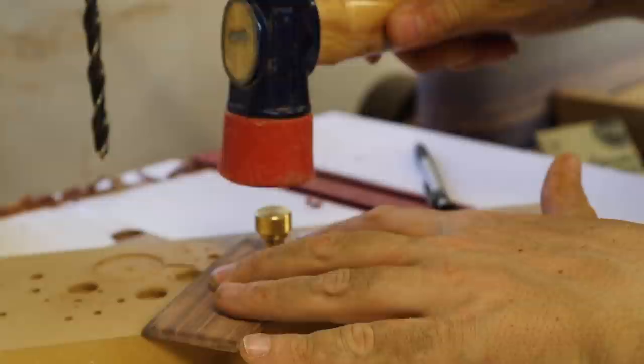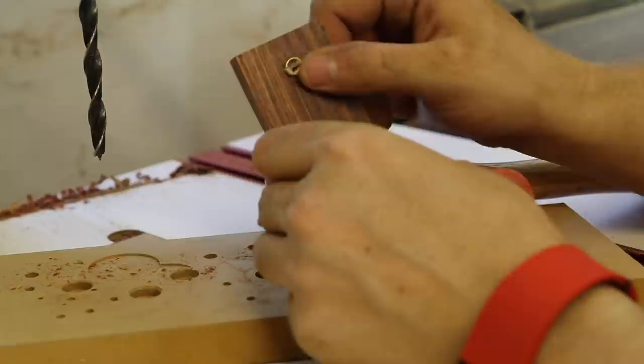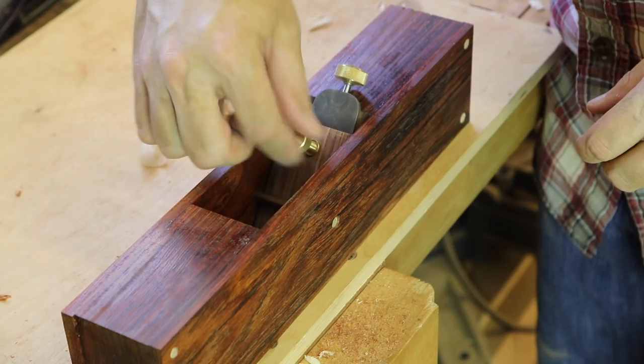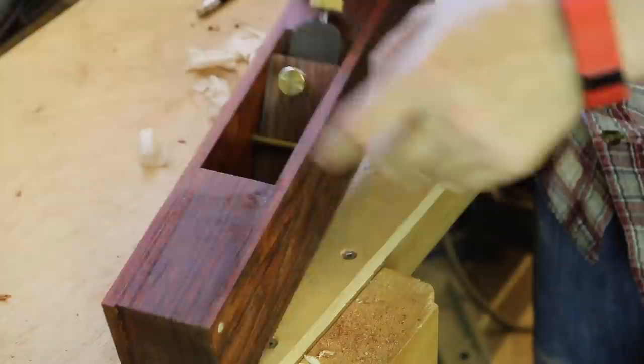Because of how hard the wood is, I took my piece and wiggled it around a little bit just to make the hole a little bit larger. Now I have my knurled knob, and I've lined this over one of the holes. It's all the way screwed in — that's going to keep that piece from shrinking. I'm going to slowly tap this in. Now that's all the way through, but it's protruding, so I've got to take this material off. The best way to do that is over at the sander. Take my knurled screw — what that does is lift the wedge as the knurled knob extends out through the wedge and applies pressure to the front of the wedge as it meets the blade and the blade meets the ramp, preventing chatter.